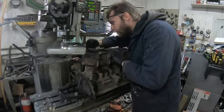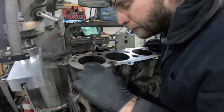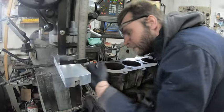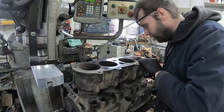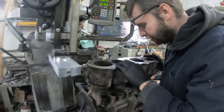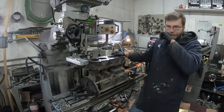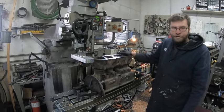You can see here now it's touched - it's like a taco. We cleaned up there, cleaned up there, and there - we haven't touched the middle yet. I'm going to see how sharp my cutter still is, pull it out and take a look. I think what I'm going to do is just tip the head slightly. It's kind of hillbilly planing. Like I said, the point in Winnipeg is most shops probably don't want to touch this old junk and the ones that do, you get questionable work. So what do you do?